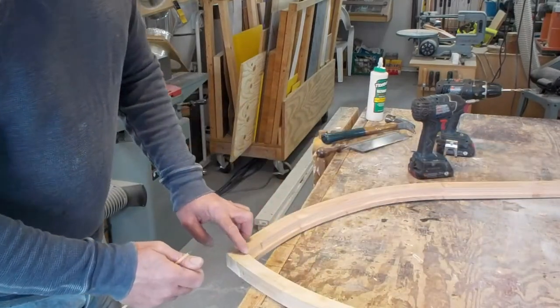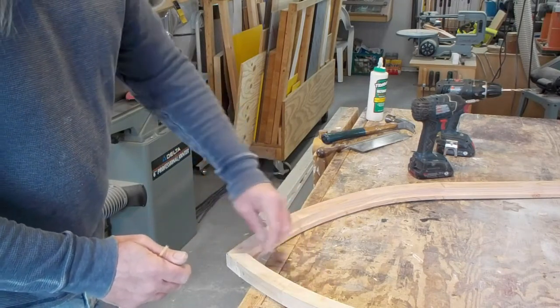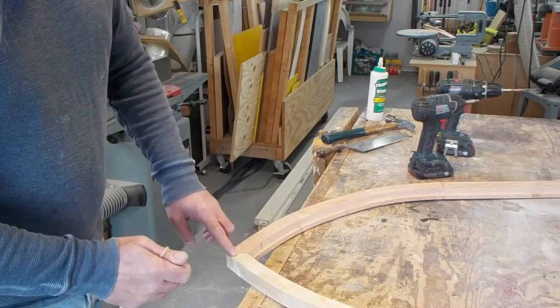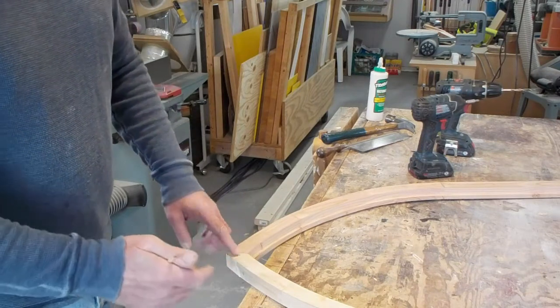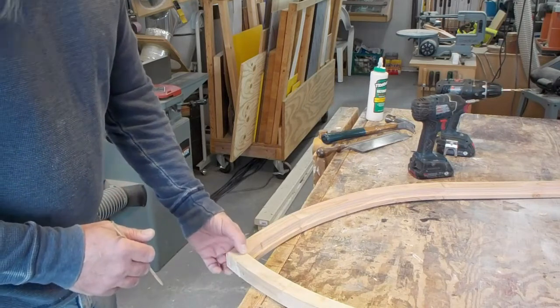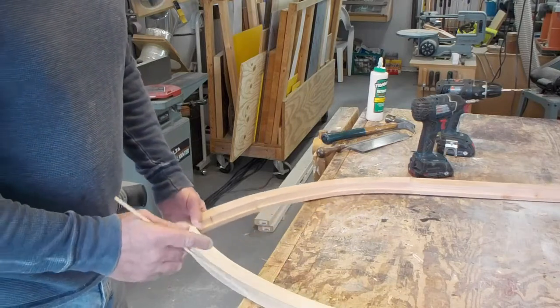As far as the bad joinery goes, after the glass panel is installed it gets putty all around the edge. You fill all this in with putty, shape it, then it's painted and you'll never see it in a million years. So it's foolish to waste a ton of time getting these joints exactly perfect — it becomes an ego thing that's just a huge waste of time.